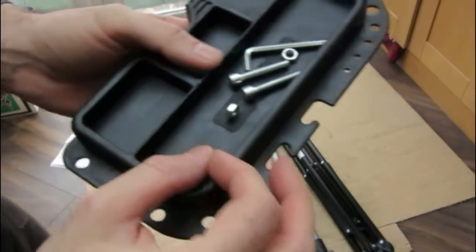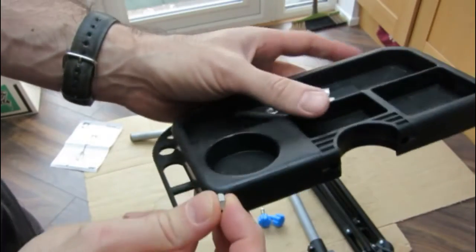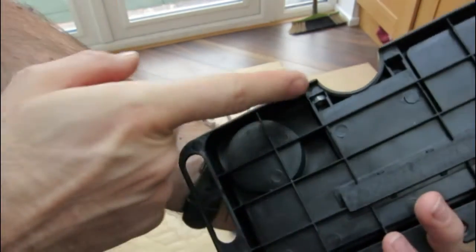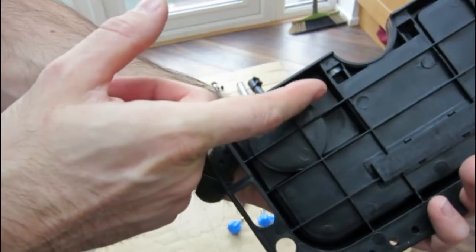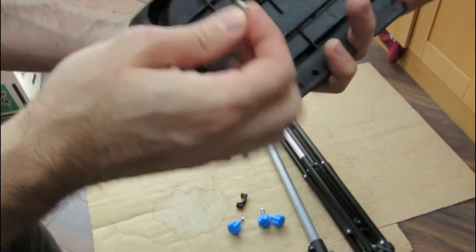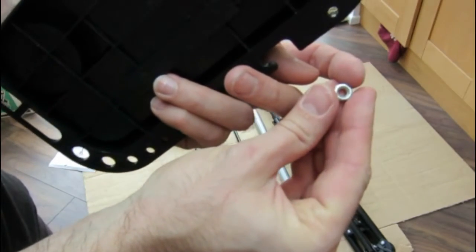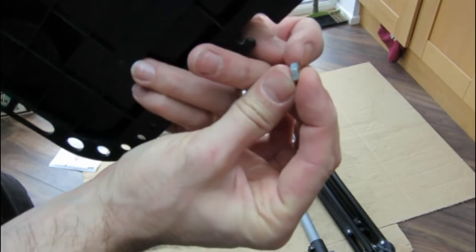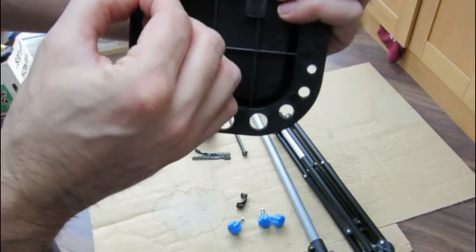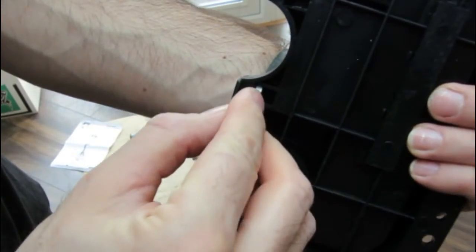It's pretty cheap. Another thing I don't like is the tool tray — specifically the nuts that come with it. Nice magnetic holder, but the nuts drop into the slots here and it's very easy to drop them out of the tool tray. I'd prefer a captive nut in there, at least one that doesn't fall out. The way I'm going to do that is: these are standard M6 and they're quite thin, but the box of M6 I have is slightly fatter and will press tightly into the slot on the bottom. So the nuts won't get lost.